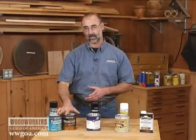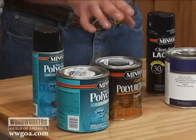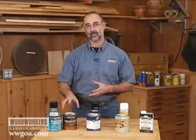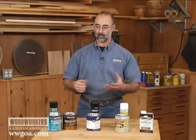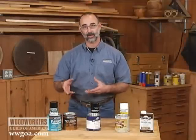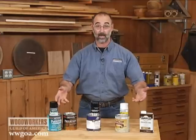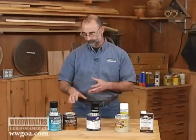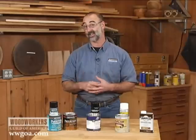If you want the best water and alcohol resistance, you want to come up to varnish. When we talk about varnish, that means varnish and polyurethane. Polyurethane is a little bit more scratch-resistant than something that's just called a varnish. The good news about varnish is that it's very brush-friendly, which means for most home hobbyists without spray equipment, this is a finish that levels out very nicely under a brush. The reason for that is that it dries slowly — but think about the negative aspect: you've got this open in your shop, on your project, for a long time, with lots of opportunity for stuff to sift out of the air and end up on your project.